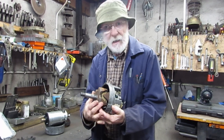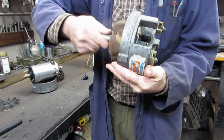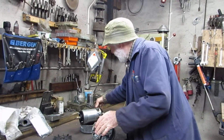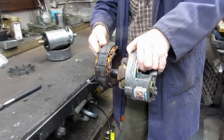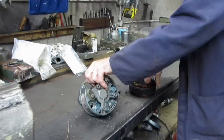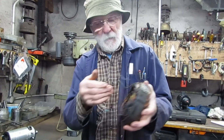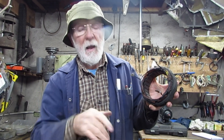Here we have a magnet. The magnet rotates inside that housing and simultaneously inside this coil of wire. This is rotating and generates a voltage in these coils. There are actually three voltages generated — one there, one there, and one there — and they all contribute.